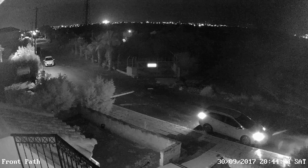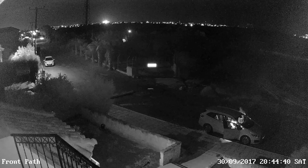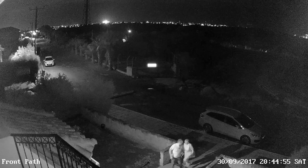The second reason is when the camera does switch to infrared mode, it seems to open the shutter up, and the picture does go quite grainy. I might consider getting a separate LED illuminator light out the front of my house just to give the infrared recording a little bit of a boost in quality. I'll see how that goes.